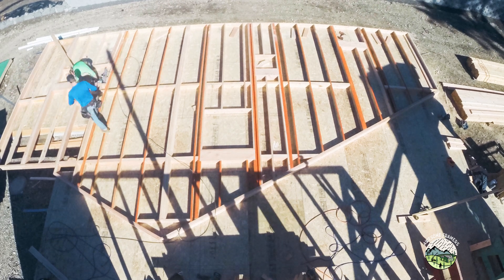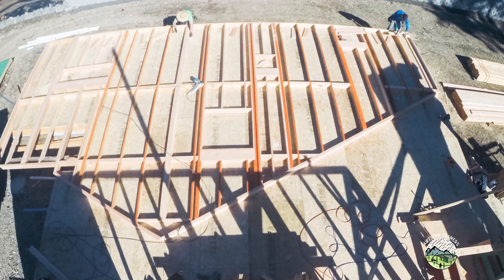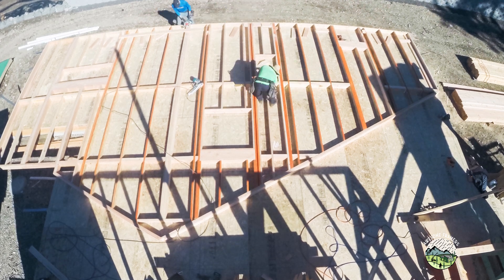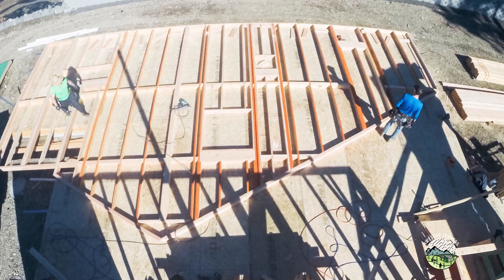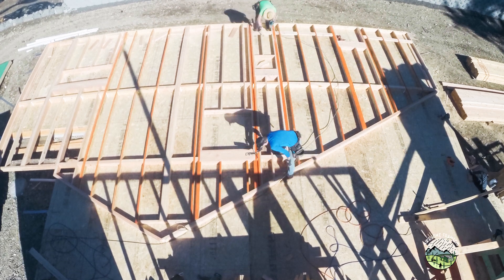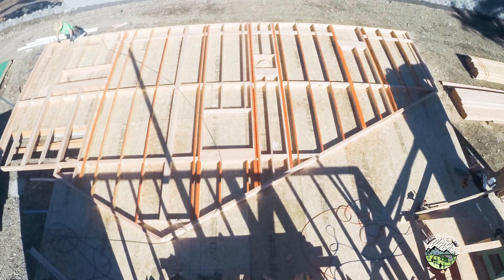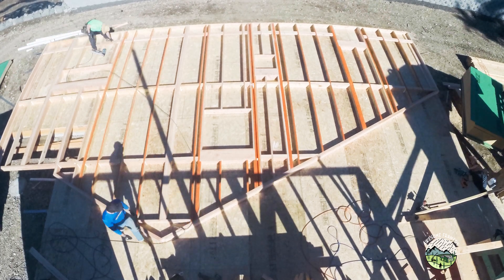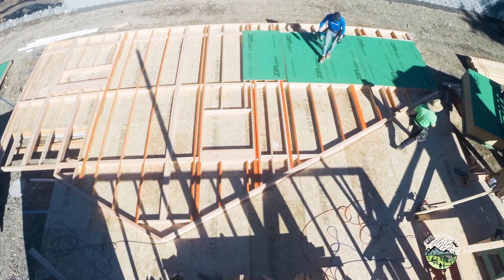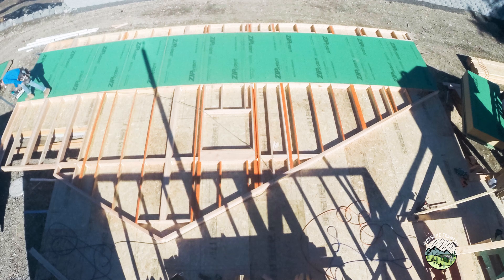After the wall's up, the very bottom row of blocking will get connected all the way down to the mud sill, so our wall sheathing about two feet up from the bottom plate will use up all of our scrap. Then it connects from that blocking all the way down to the mud sill, making for a nice connection. It's also a great way to use up all your scrap — we end up with almost zero scrap on these walls.